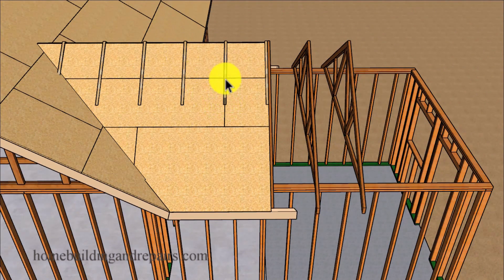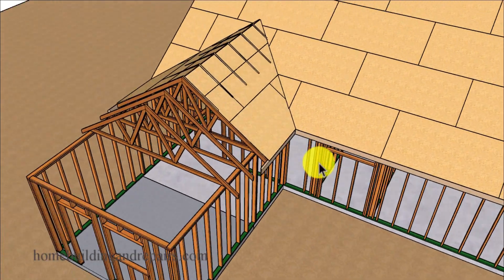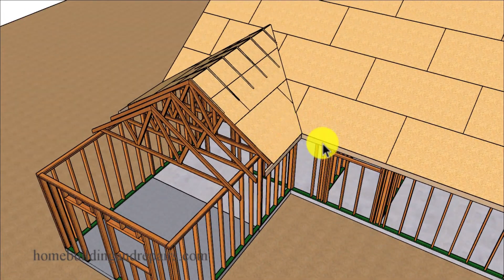When we do something like this we could end up with a small variation in the fascia board, especially over in an area where the angle of the new fascia board is going to be cut square rather than plumb. If it's a plumb cut like we're looking at here, you might not have a problem. However, if it's a different angled cut, you could end up with a slight variation here, so just be aware of that.